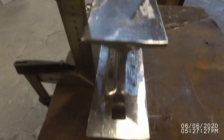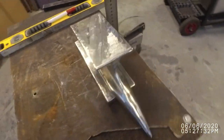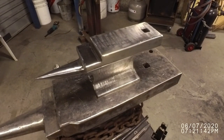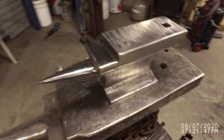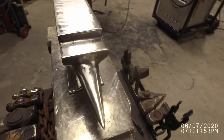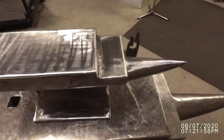I've taken the whole surface back and she's ready to weld. I'm going to wheel the welder over and do a few tacks, get the oxy out, heat it all up. It's pretty warm because I've been grinding it, but I'll heat it all up and then give it a good deep weld. All the welding is done and all of the grinding is done - there she is all cleaned up and ready for the next stage.